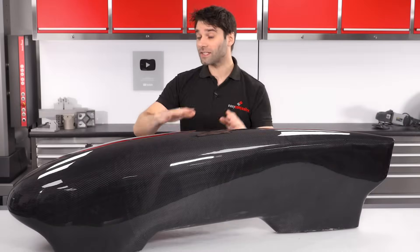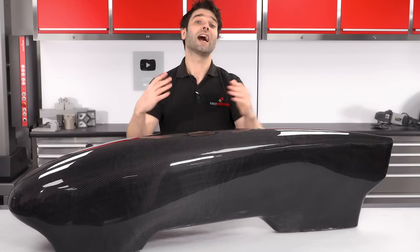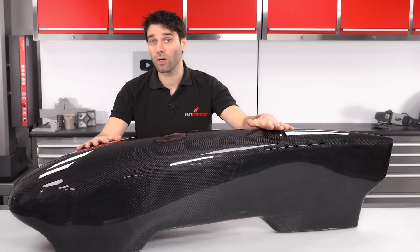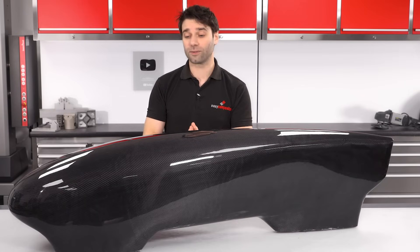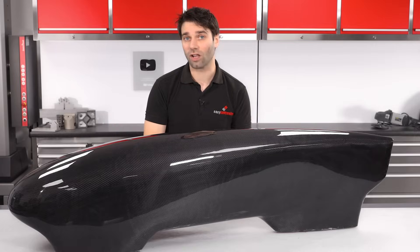That's our final coat of resin cured off, and we're already starting to get a really good finish on this part. But to get rid of the last little ripples, waves and nibs that are left from the coating process, I'm going to do another round of flatting and polishing. Because we have quite an even substrate to work from, I can start out with a finer abrasive — starting at 400 grit, then working through the grades up to 2000, before going on and compound polishing up to its final gloss.